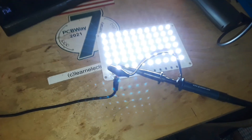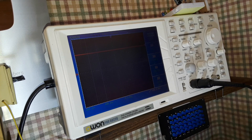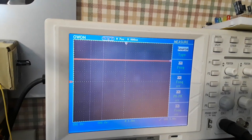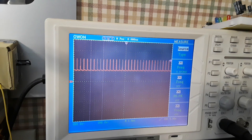You can see the LED plate with the scope hooked up via a couple of probes. Let me get this up so I can see what I'm doing. That is at full power — let me come in so you can get a better look. There's full power, and as you can see there's really no frequency at all. Now let's start taking it down — and there it is, the PWM shows itself. Very nice — I had a feeling there was PWM in there.